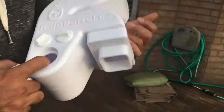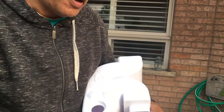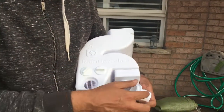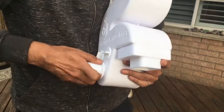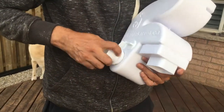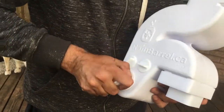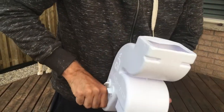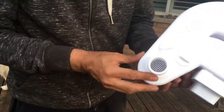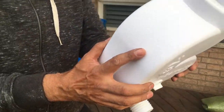On the open side we are going to install this connector, but the connector needs to have a little mesh. The mesh is there to trap debris so it does not end up in your rain barrel. We just place the mesh here and then connect the connector on this side. It needs to be connected properly so that it does not leak. Make sure the mesh is in place when connecting it — hand tighten only, no need to over-tighten because it is all leak-proof. The rain barrel diverter is now ready for installation.